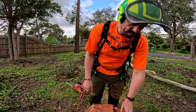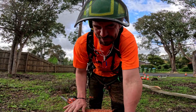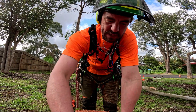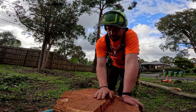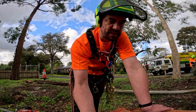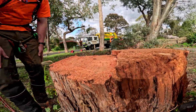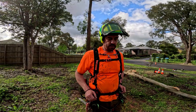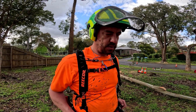Beautiful. I've been caught before with steel wedges — if you look back at some of the early videos, I've nicked a steel wedge. So I went by the book this time. I cut more than this out for the top quarter, and I left it very thin because I didn't want to go back to that side — all that is to stop it crushing down on this side. Then on the other side, to avoid hitting my steel wedges, I went by the book: a step down underneath. You never undercut your wedges, you go a step down lower, and you get this snap out along the middle. So that's a wedged quarter cut that no one died on.